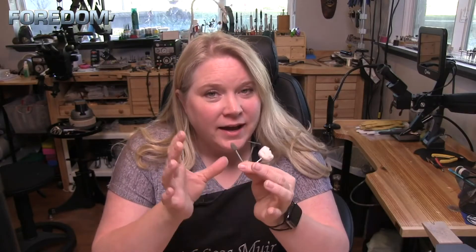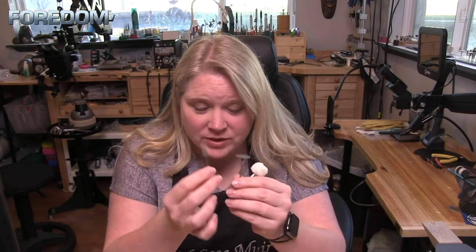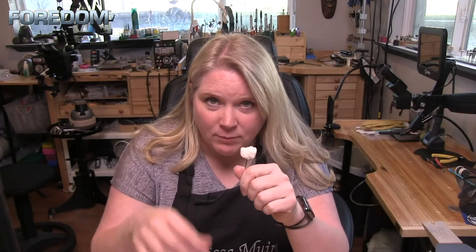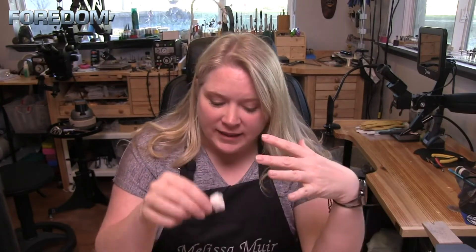In this video I have used some very simple accessories — a couple of silicone polishing accessories, some of which I've reshaped, as well as a fluffy cotton buff. This allows me to get that finer finish and that nice bright high polish. It's very important that you clean very well between each of the different steps because you do not want to cross-contaminate any of those different abrasives. I'll include links to each of these accessories down in the description.